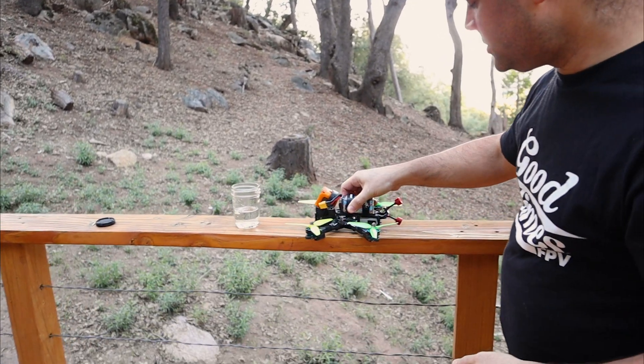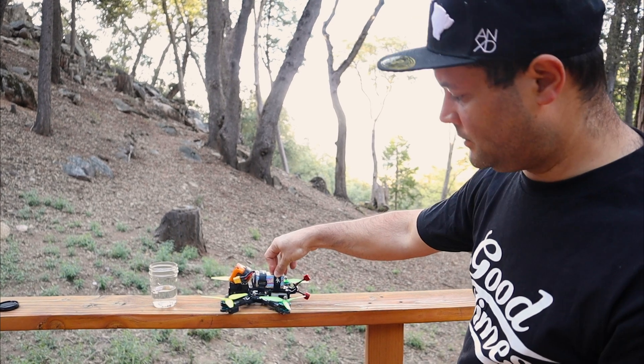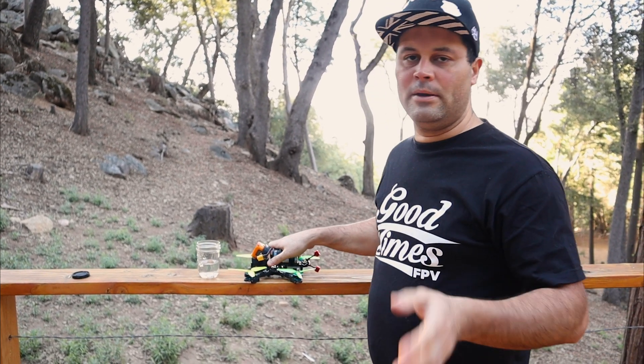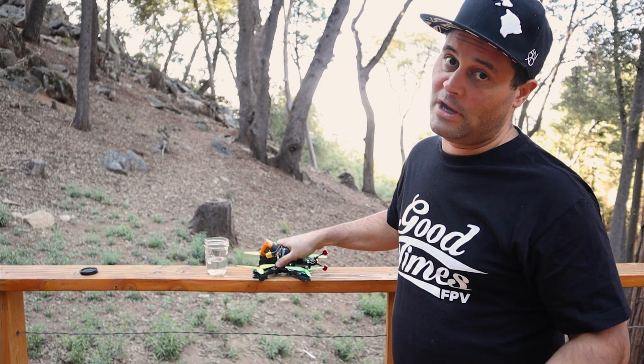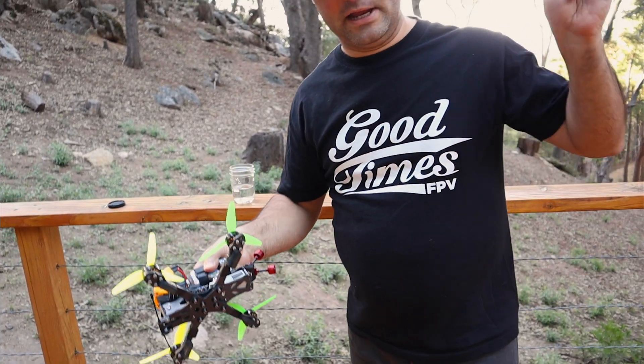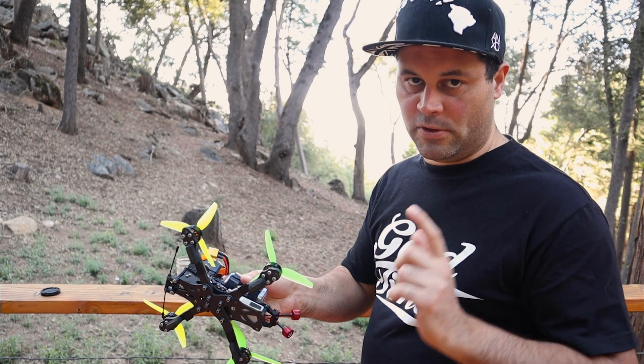Going back to this build — a couple of things to note: I go for lightweight. The motors are light, I run 5S instead of 6S most of the time. If I can, I'll fly a Session 5 because for freestyle I feel it just feels a lot better. I don't use HyperSmooth, at least not for freestyle. If I do long-range I'll use it, but for freestyle I like it raw. I try to fly as smooth as possible. Very rarely will I put a Hero 7 on it, and if I do, HyperSmooth is usually off. I run this setup of antennas — I have a video about it — which shows why I went with this setup, because it's lighter and I don't have to deal with 20 grams worth of SMAs.